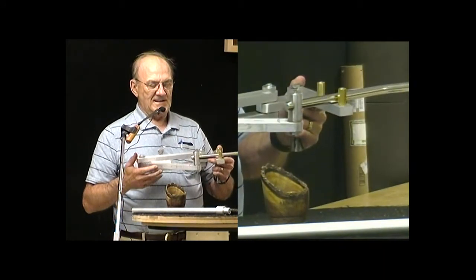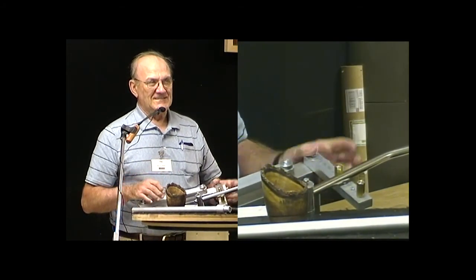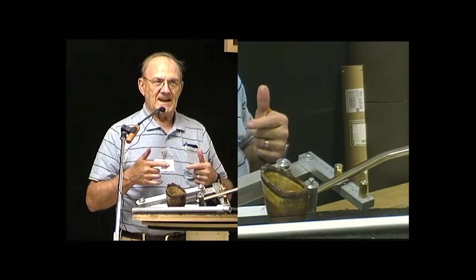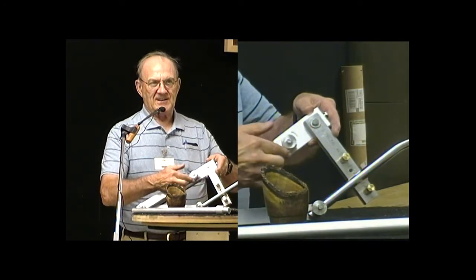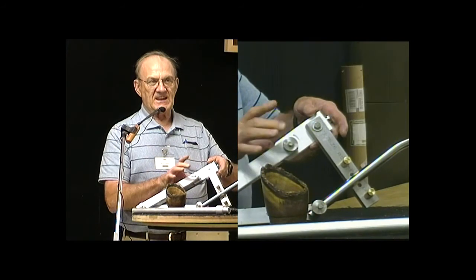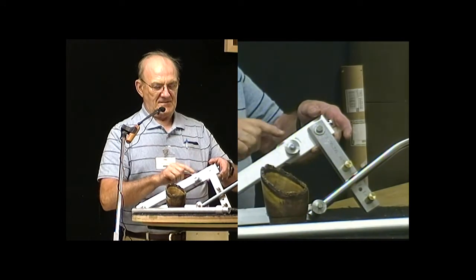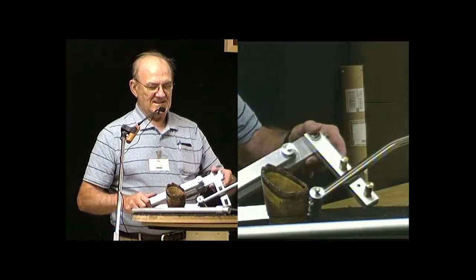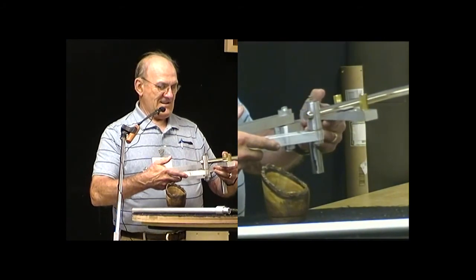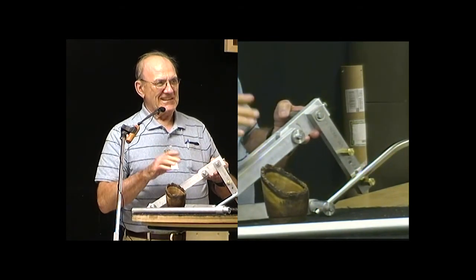So the other trick of the trade is, how do you get the nice tension so that it moves relatively smoothly without precision boring, to give you, you know, true craftsman, is to use a shaft that you drill on both ends and tap, and then you make a cap that sits on top of the shaft and put a spring washer, or in this case just a split washer, but I'll use a dome washer, so that what you do is tension these parallel bars by tightening the cap that you're putting over the shaft that goes through it. So when it's all said and done, get your wrench out, do a little adjustment on the tensioning springs, and put it on your lathe, and then you find out, oh, darn, this piece is 1/4 inch too short. Yeah, you know, I didn't use the tape measure to lay this out. I just went and made it.